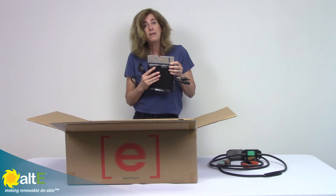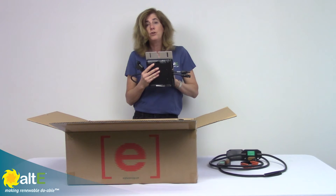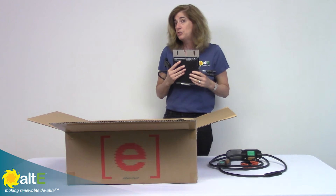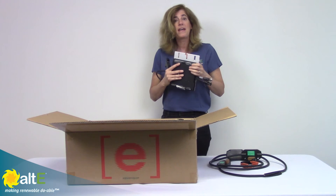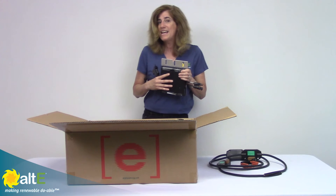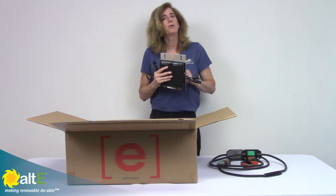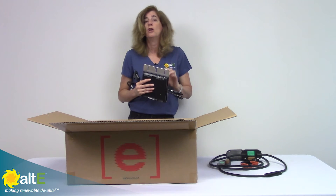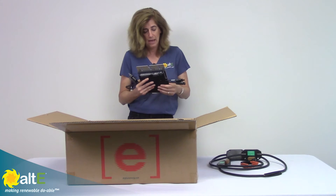They also can be used in three-phase. So if you needed to set it up at 208 for three-phase, you can do that as well. They also have a model that is a 250-watt, 277-volt, 480-volt Y three-phase. That one is flexible and can be used with 60-cell or 72-cell panels, so it can be used for 20-volt and 24-volt solar panels.